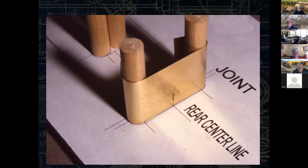And if you look, this is the back of the tender. You see we have straight rivets down here. We have the offset rivets here and here. We've now bent that around. This will want to relax to a point. So you want to overbend it a little bit, or you can anneal it with a torch. I wouldn't do that with the wood and the paper. That'll all work out.